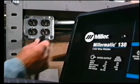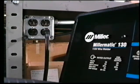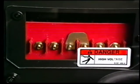Supplying primary power to the Millermatic 130 is as simple as plugging the machine into a standard 115 volt AC 20 amp household receptacle. The Millermatic Challenger, the 185, the 250, and the Vintage all use single-phase primary power of 200 volts or greater. The Challenger uses 230 volts AC, while the other models use jumper links to accommodate a range of voltages to fit your shop requirements.